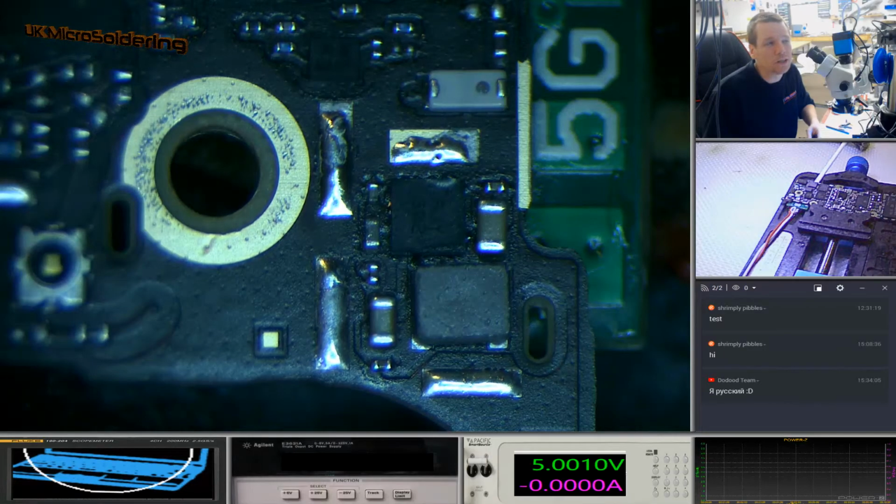I mean, we don't really do liquid damage repair. We'll assess the damage on the board and see if it's worth repairing. If it looks like that sort of damage up in the corner, I will repair that. We'll pull the chip, we'll clean everything up, see if it works, if it's localized. If it's across the whole board, it's just not economically viable to be able to do that. So the quicker you get it into a repair shop, the quicker they can clean it to stop this sort of excessive damage, and then you're not going to have that issue.